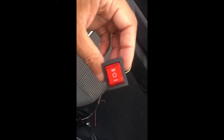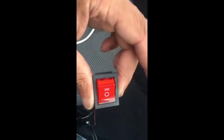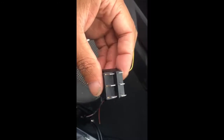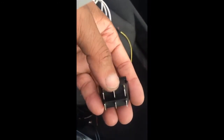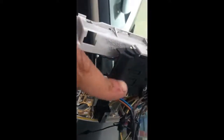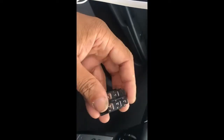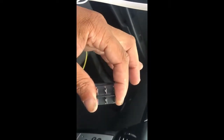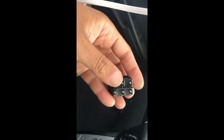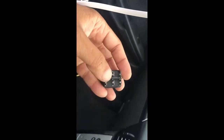This is my switch — it is just an on-off-on, so one position there, one there, one there. In the back it has six pins. The two middle ones go to the minus. Then you have one on each outer side — so one of them is the minus and one is the plus on each side.